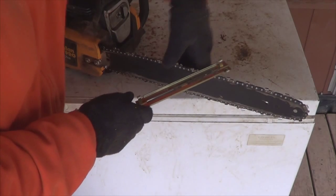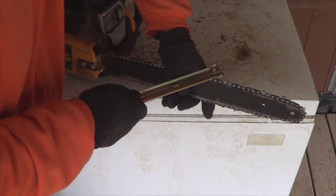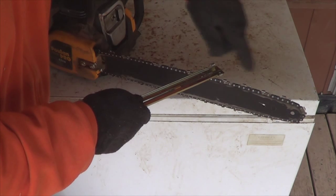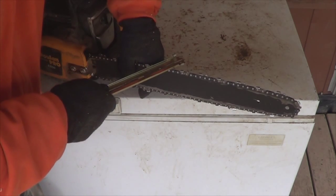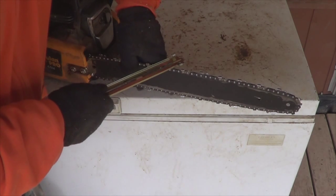If you're sawing and that blade turns left or right, without this little gauge you can tend to sharpen one side sharper than the other — whether you're right-handed or left-handed — and that's going to cause that drift. This little gauge is pretty nice. It's got lines on it for a thirty-degree angle, which is what I use. You just line that up with your bar and take a stroke — it doesn't take but a couple. The tooth rides underneath the gauge so it keeps all of them the same depth, and that's what you want.